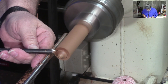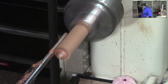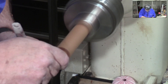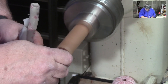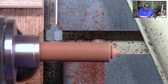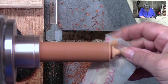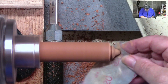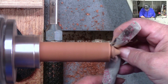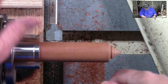I'm just going to kind of round this side back here over. We're going to go ahead and hit that with some quick sandpaper — this is such a quick little sand, especially with this mahogany. Some of you have been asking me to do more sanding. So that was 150, we're going to hit it with some 220, and then come in with some 320. Pretty much that's what we're going to put on the top.